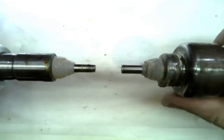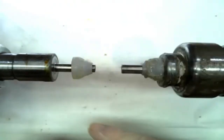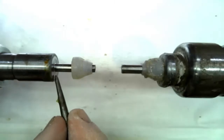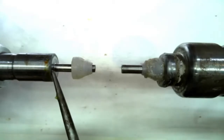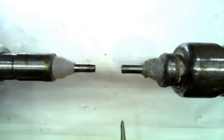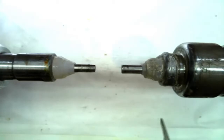The only nice thing, if you're going to purchase it through Exotic Blanks, Ed is the only one that's doing this. If you ask me, there's a fundamental flaw in the design of this thing. I know it's really hard to see, so let me pull out a pointer. Right where this is pointing, there's a little divot here, and then there's one on the other side too. If you put too much pressure on, your bushing can actually get stuck in there. So Ed provides a 1/4-inch nylon washer. You put a nylon washer on this side and one on this side and put your bushings against them, and you never have a problem with anything coming in or out.